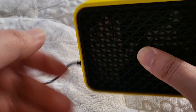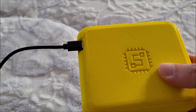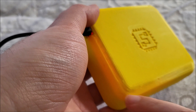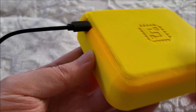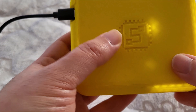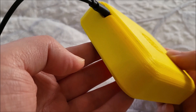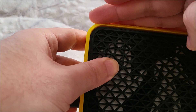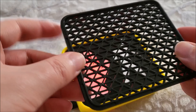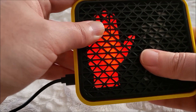Another little thing - I put my logo set into there, which is really nice. I used yellow filament because the original traffic light has a black and yellow kind of motif. When I light up the LEDs, I notice that because of the infill percentage I used - I think 20% - you can actually see through the edges as well as around the jack where there's a hole. So in the dark this is kind of noticeable. I would probably go with increasing the infill or maybe spray painting the inside black if you really wanted to light-proof it and only have light coming out the front. Also, because of that gap I made at the top, you can see a little bit of light spillage. If you increase the size of the front layer a couple percent, you should be able to get a tight fit that'll prevent any light leakage as well.